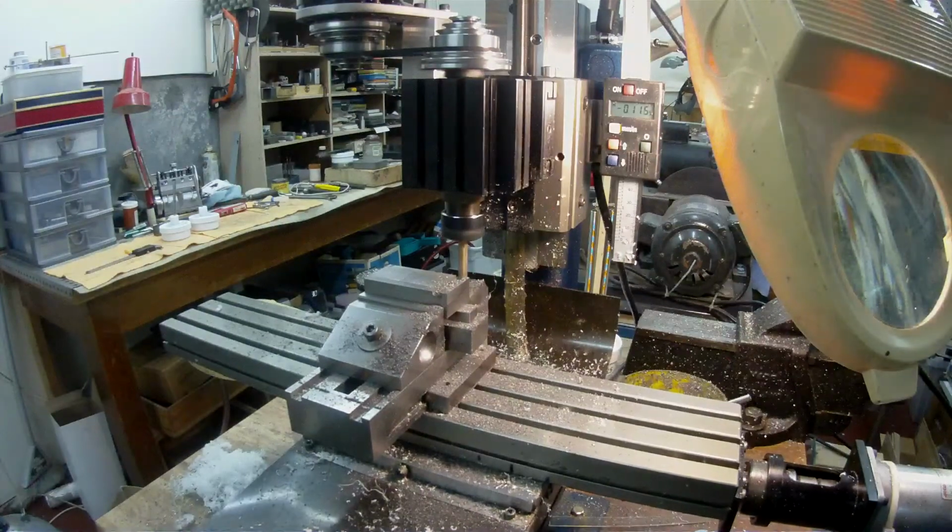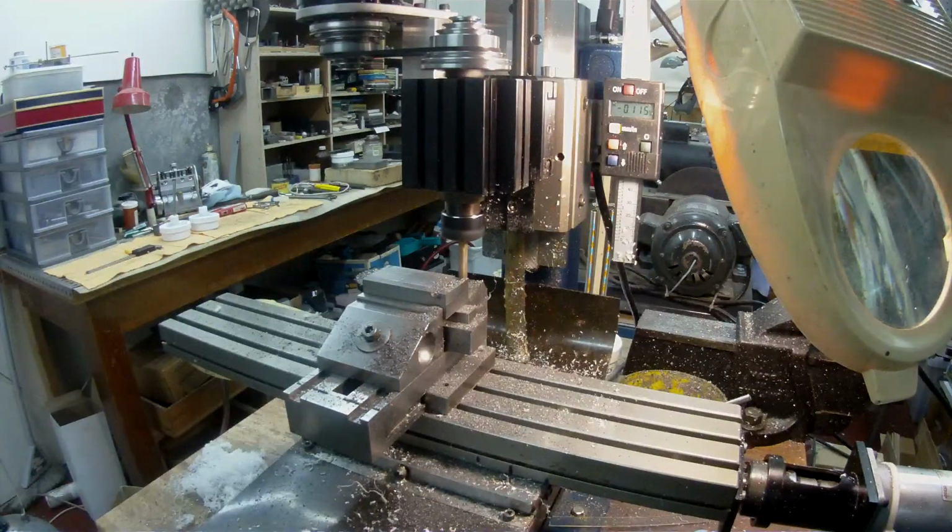Okay. So at the moment I'm using a 1/4 inch cutter, by the way, a 4 flute with broken corners. They've got a gold plate on the cutting edges, on the lower half, some kind of material that's been added on there, and I find that these cutters really are nice. And not only that, you can also plunge with them, because the two opposing flutes are like a slot drill, so it works very well.